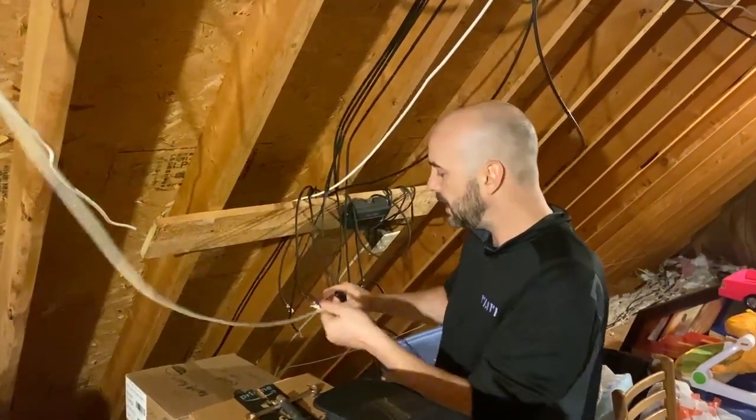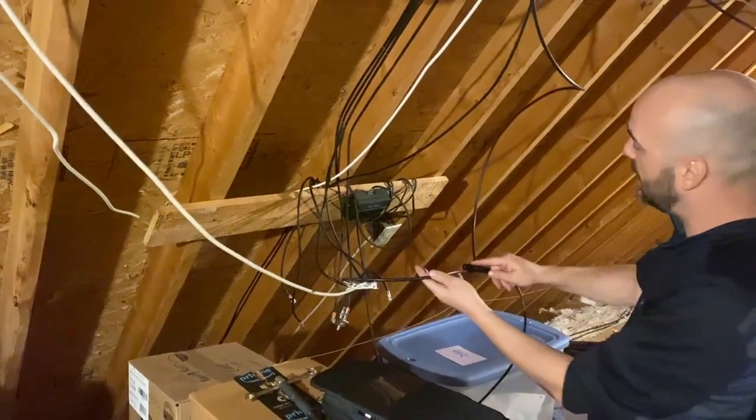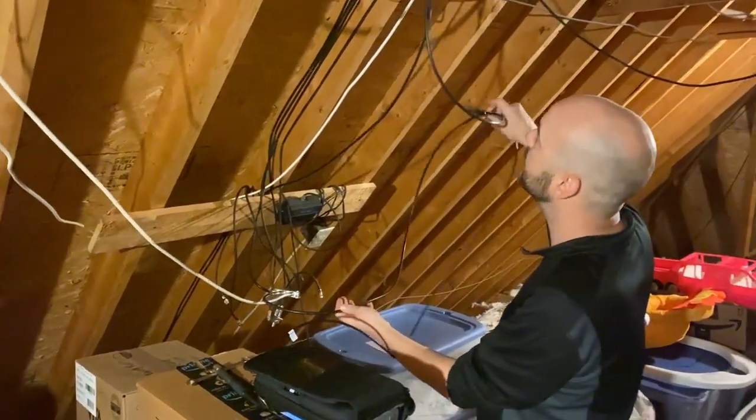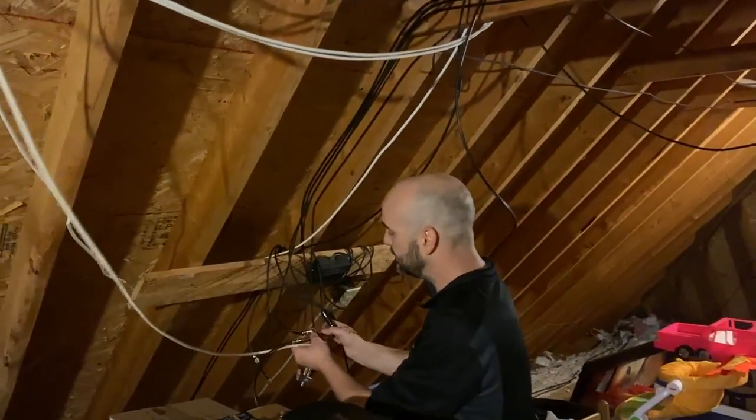Really, it's a workmanship issue at that point. Just by tightening that down, we're not really picking up any leaks. But if we desired, we could actually scan the rest of the coax with the near-field probe. We're not picking up anything though — everything seems nice and tight.